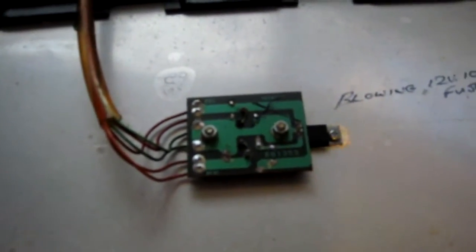So I opened up a spare MPU4 board and saw this written on the cover on the inside: 'blowing fuse', and a cross written on the regulator board. So I'm guessing there's probably a short on this, and I don't want to try it in a real machine and risk blowing fuses. What I'm going to do is use a bench power supply here to basically current limit it and power it up to see if it's actually shorted or not.